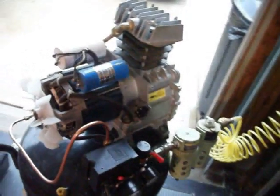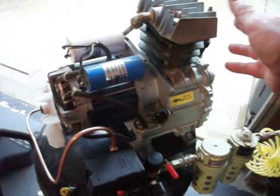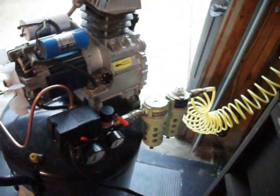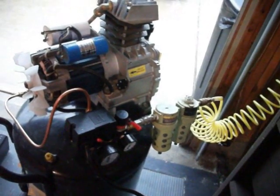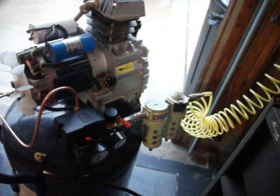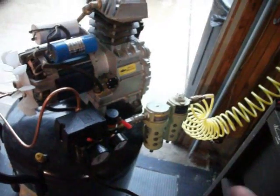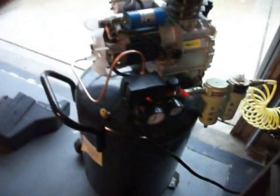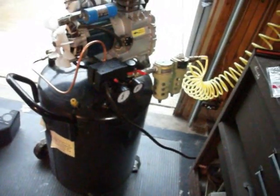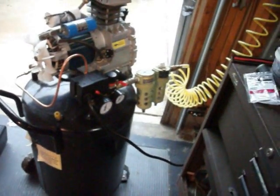And the other thing is, this compressor basically is an aluminum machine, okay? And one of the things he noted is that he put the new oil in there when he first got it, and he ran it steady for an hour, and then he stopped and drained all the pressure off and disconnected it, and then took the plug out and drained the oil, and what he found was very fine aluminum shavings. That's probably not all that unusual with break-in.